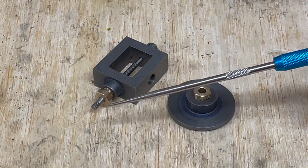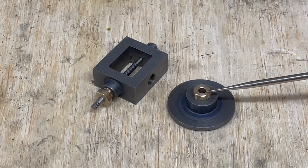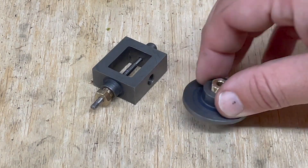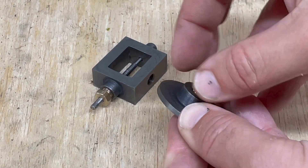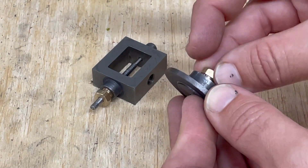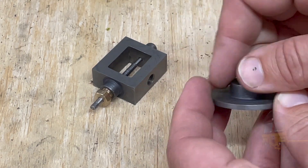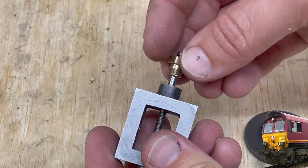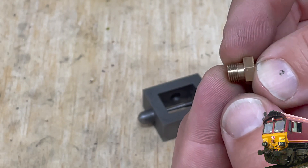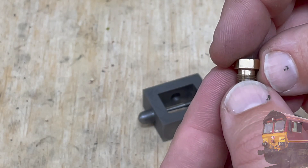These are the two brass nuts that I have put together. This is for the piston gland and this is for the valve gland. They are created from some hex stock and threaded — this one is threaded 5/16 by 26 and the other is 1/4 by 40. Unfortunately I had made this perfectly and then during parting off I scuffed it there, so that was entirely my fault really.